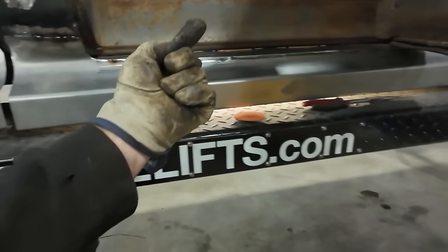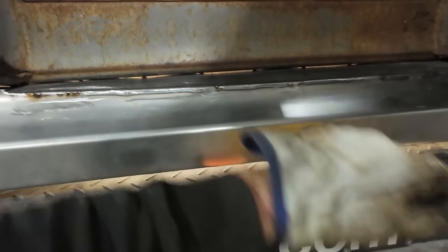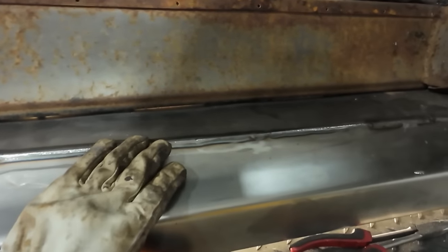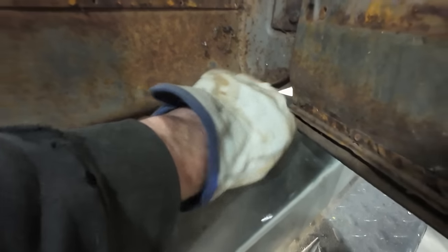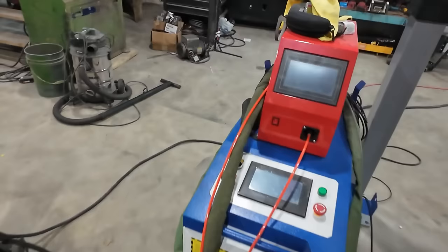Well, we're doing not too bad. We got this in here. I just screwed it up from the bottom side. You can see we'll probably seal that, but I just wanted to get that fitting good. We laser blasted that, that was awesome. That welded nice. We had a few stragglers because the metal just wasn't butted tight. It's like a fusion weld, this thing, but it actually has a wire feed.